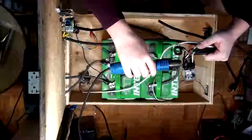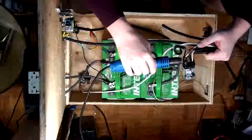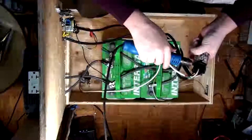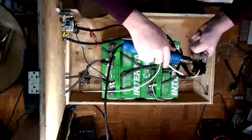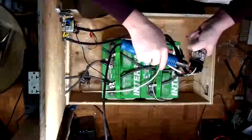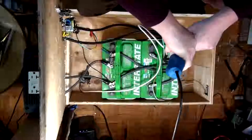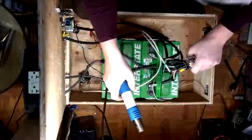There we go. Yeah, no, I'm thinking about it in my brain right now. Once I get this thing working, tested, and proven, I'm going to order a contactor as well, a 30-amp contactor as opposed to a relay. I'd rather have contactors in place and all the proper electronics in place than this jerry-rig built in somebody's garden shed UPS. There, so that looks pretty good.